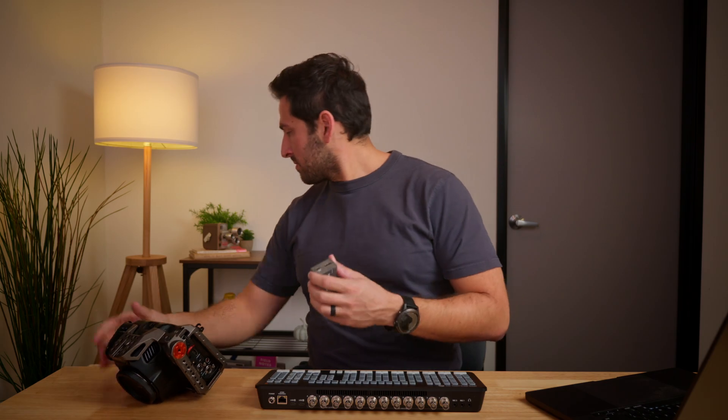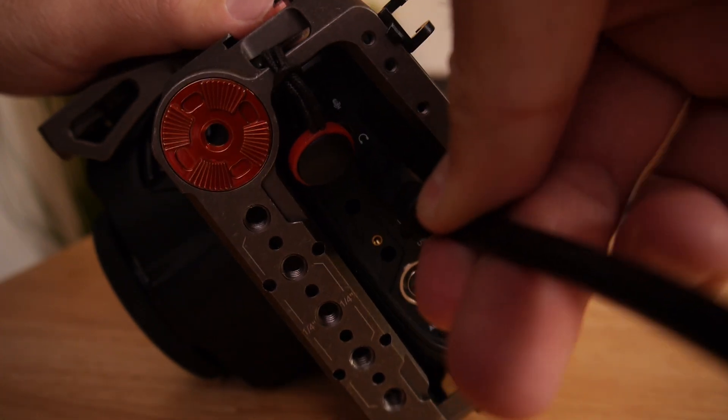You're going to have your camera connected via HDMI into your bi-directional converter. You'll need power for the converter, and then you will have two SDI cables going between your camera setup and your ATEM. For this to work, you have to have two cable runs. HDMI is bi-directional — it can receive and send information both ways — but SDI is only one-directional. So you need one SDI cable to send the video signal into your ATEM, and a second cable going out of the ATEM back to give the camera control, timecode, sync, and all that information.